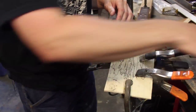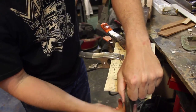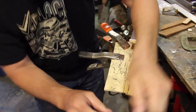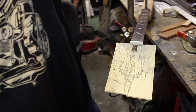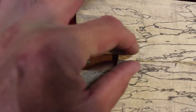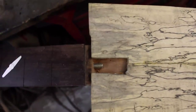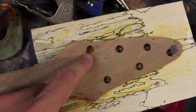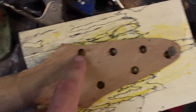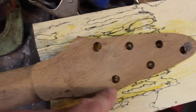Well, here we go — it's the next day. Hopefully the glue is all dry and we'll be left with a nice little veneer here. Uh-oh, we're stuck. I glued the clamp to the guitar. Screwed up two things yesterday, so I do like full disclosure: I overcut that line right there, so my little truss rod cover will have to be a little bit bigger — I should have coordinated that much better. I drilled my pilot hole and the bit did not follow the pilot hole — it went off this way, so I drilled it back where it was supposed to be and we'll just have to fill that in.